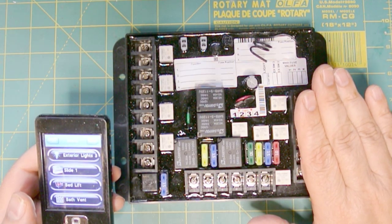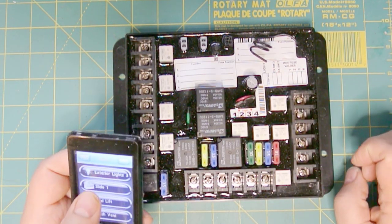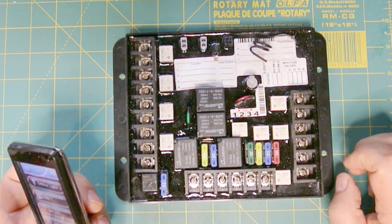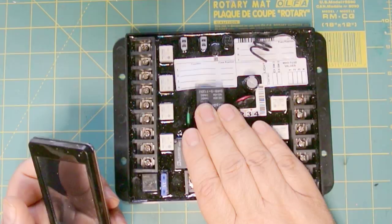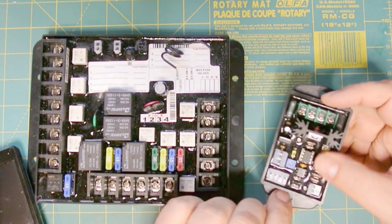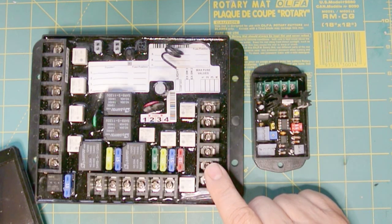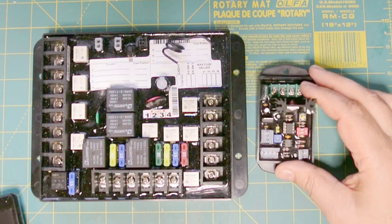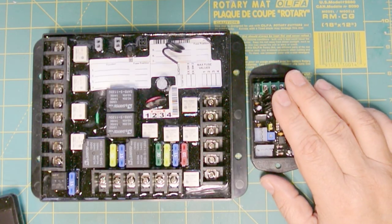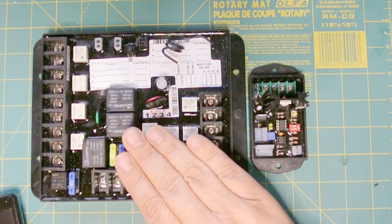So if you wanted to control lights, if you connected the light to one of these, you'd have to hold the button down to keep the light on. But I'm not aware of an adapter that will provide the latching function for the light. And this is one of my dimmers. I especially designed these dimmers to be able to use that momentary signal from here, so you're going to have to build a bunch of these or find somebody that's designed something like this to be able to get this to work if you want to control lighting from this receiver.